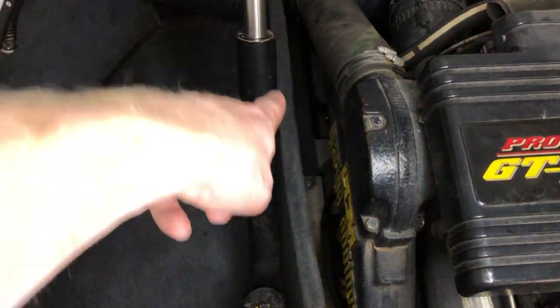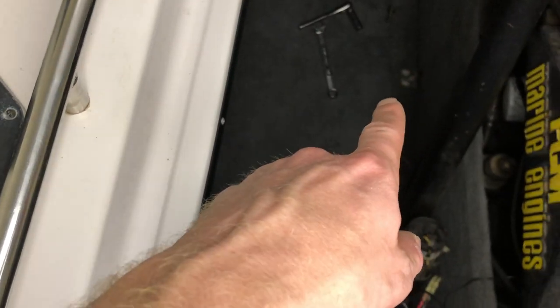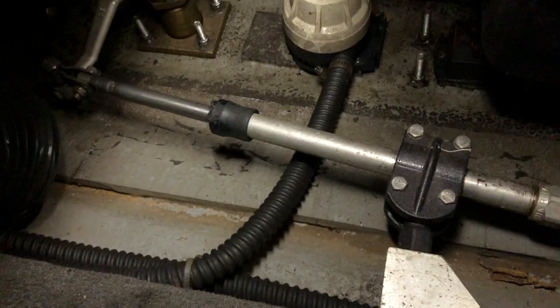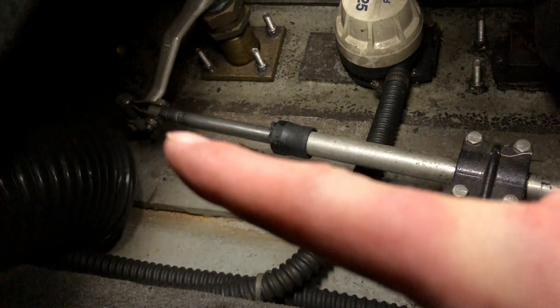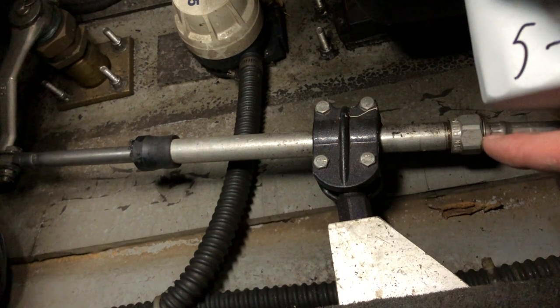Back here in the rear hatch, you can see it right there — that's where the rudder connection is. I'm going to take this partition out, which will give me easier access down there. There's just an L-bracket that I had to take out, and then right here there are a couple bolts. You're going to have to loosen that bolt right there, and then come back and loosen that nut right there.